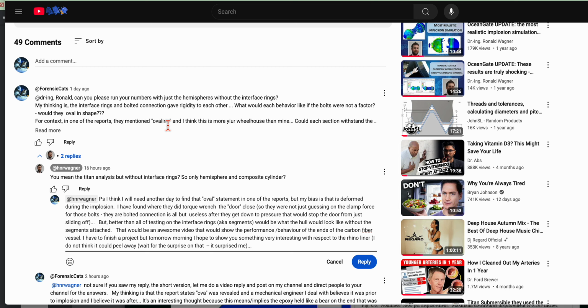The fiber, end fibers, really makes me wonder about that since they said they had a cut, not that it came that way. But I do like the idea behind half-inch strips because you get carbon epoxy on it. Every half inch, you're getting epoxy on the interface side, the lateral gluing of it. And it lays it down just like Scotch tape, if you will. Really, really nice. So it's getting that epoxy bond from one to the next. And then there is some overlap because it's on a skew when you go back and forth.